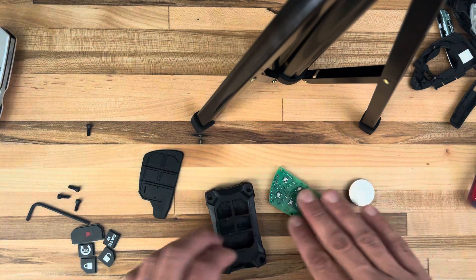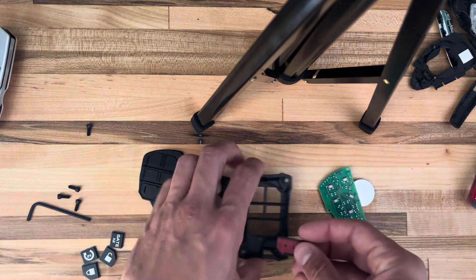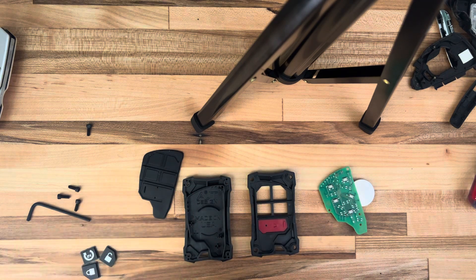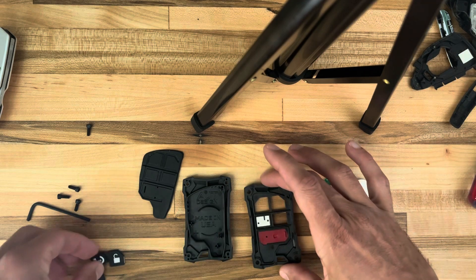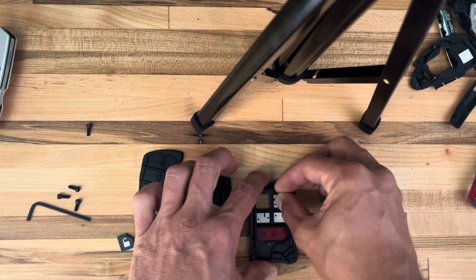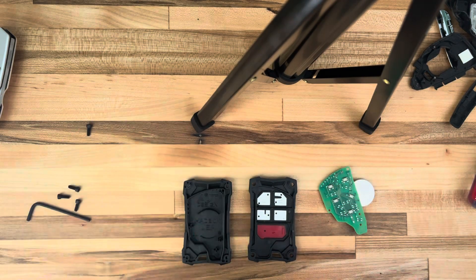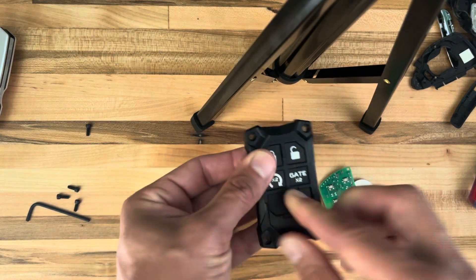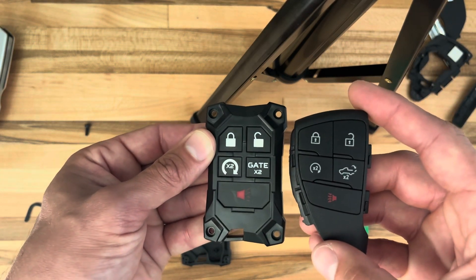With that apart, this piece is discarded, this piece is discarded, and we have what we need — which is basically just the circuit board and the battery. Now comes the easy part, which is assembling our case. You take the top half and load in the buttons, making sure you get these in there the right way. It is possible to fit the wrong buttons in the wrong location or have them upside down, so just double check that before you put it all together. The gasket goes on top of that, and you can flip it over and check — it should look just like that, and all the positions should line up with the factory fob.